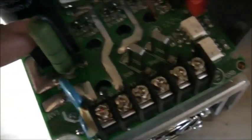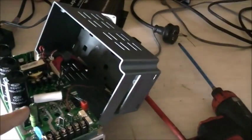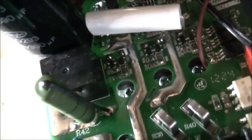Little relay there which clicks — so if I hit the stop button, the motor stops with that one here. It goes click and it puts a brake on. This resistor discharges it through the motor, and this relay is what clicks to turn the brake on. Song Chuan 24 volt relay, 7 amp, 250 volt, 50/60 hertz.